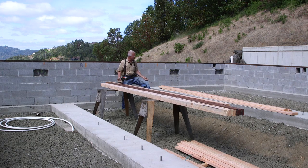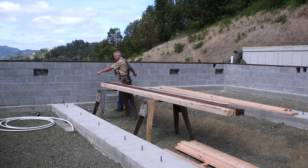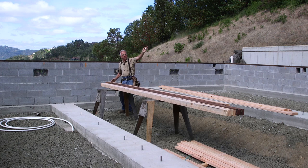Here's what I'm not doing: I'm not trying to build these pony walls to the exact height of the bottom of the joists, because really how am I going to do that? There's a little fluctuation in the height on the two sides and on these strip footings. So I'm going to build these pony walls half an inch short - maybe five-eighths of an inch short - and then shim at each bearing point, glue and nail little shim packs down to get right up to exactly snug and no more against the bottom of the joists. The layout is tricky. I have to reflect the underspan adjustments we just talked about in both walls exactly the same in the first part of the layout, and then once I get to the standard 16-inch layout it should just be standard 16 and go.